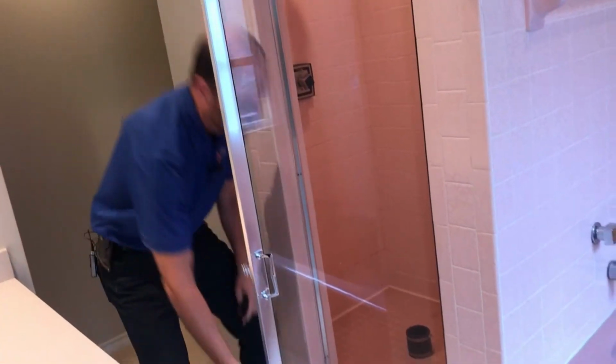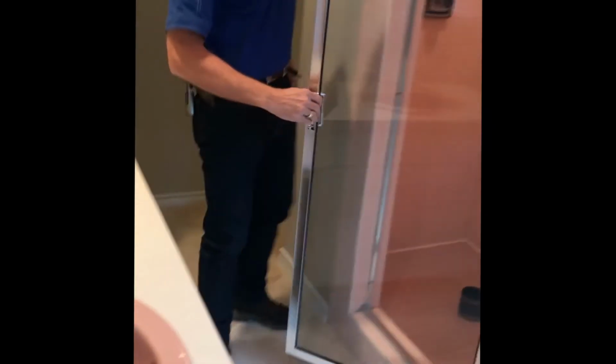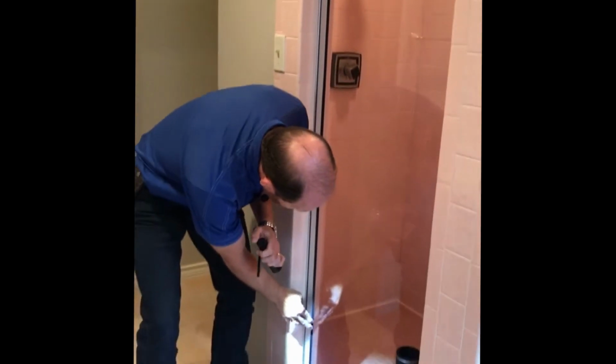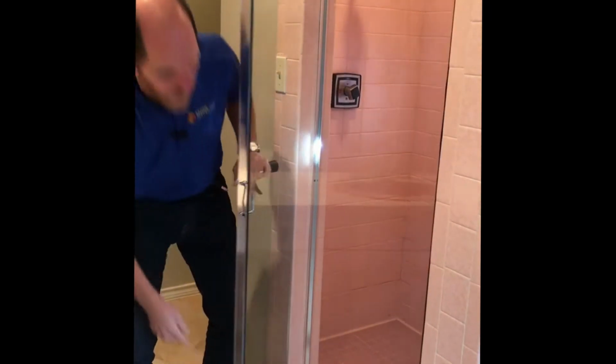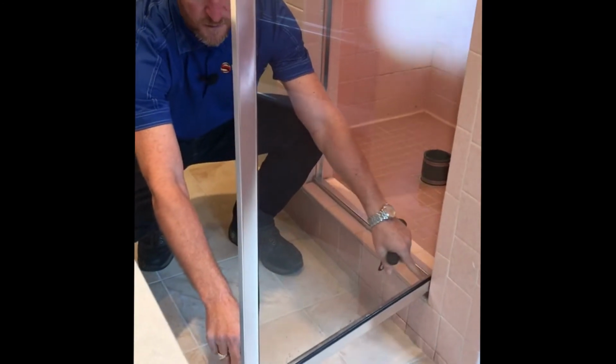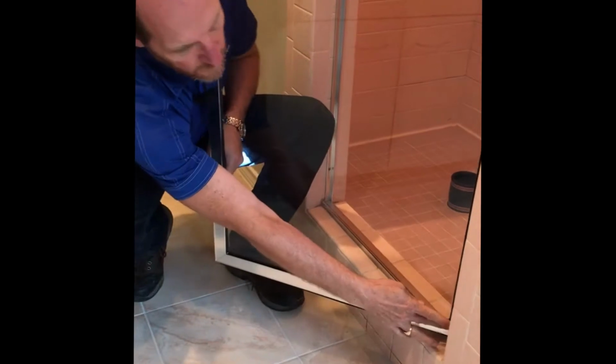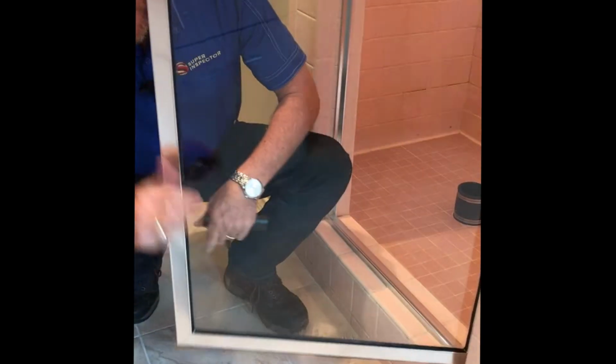that we have water seal. So we've got the rubber seal here. Latch is good. Check the seal all the way around. This actually looks like they put a new door on fairly recently, and everything looks in good condition. There's no corrosion around the bottom. Sometimes water will get in around the bottom here where the seal is not sealed good, and you'll start to see corrosion forming on the outside of the door.